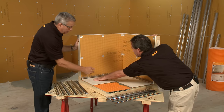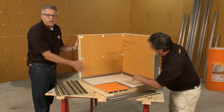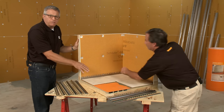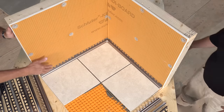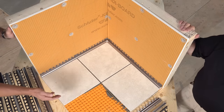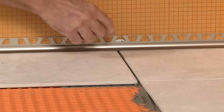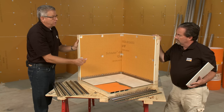If you do end up with a gap, this particular profile we're using — this cove — you can see it's top-set. So whether you have an existing floor where you're doing tile and you're going to set this on top, or maybe you have some other kind of material on the floor other than tile, you could utilize this cove. Of course you want to spend some time getting that in, or else you may need to put a sealant underneath there.